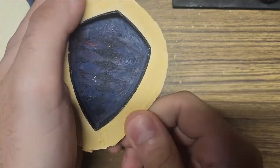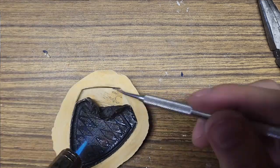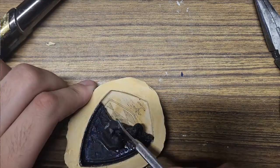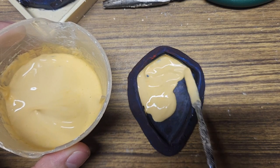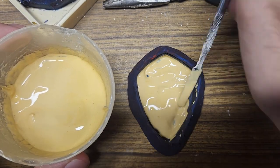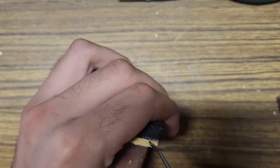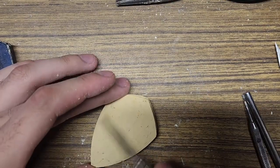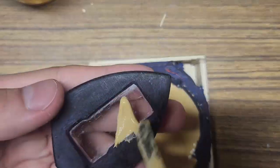There are a few reasons that led me to experiment with this material for this project. Firstly, I don't find it cost effective to design and machine a mold out of cast aluminum for a one-off piece. A 3D printed negative mold might work well if done correctly, but because I'm using pre-preg carbon fiber, the mold will not survive a 120 degrees Celsius oven. Secondly, there is an option of using epoxy resin, and though I have some, it tends to be expensive to purchase, especially in small quantities, and it is not repairable in the case that you make a mistake during the casting process. Most importantly, a lot of epoxy resins will soften up at high temperatures, which would not work for pre-preg.